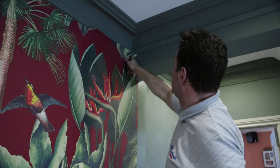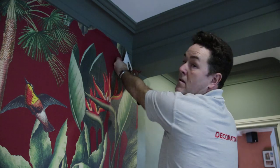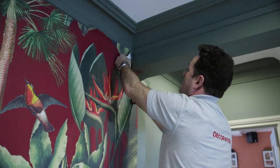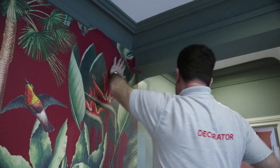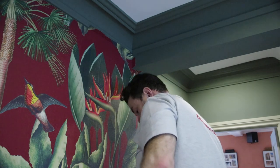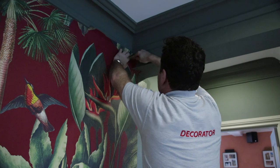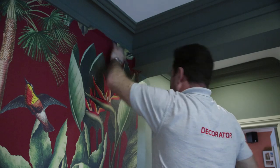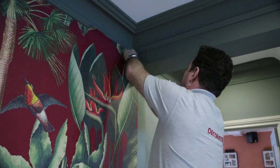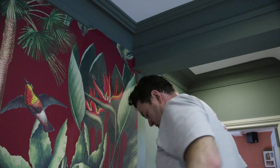What about that corner up there? Feel it with your finger, push it in. I know where it is — I'll pull it back. I can see with the way it's creased on the corner. I'm just going to cut into it — not all the way. Then I'm going to cut straight across that angle. It doesn't have to go straight up to that corner. I've got it all in. Let's not forget where that screw raw plug is — poke it through with the screwdriver. Let's get these down, put them really neatly in. Let the paste up — there might not be enough paste there, move it all the way up. I've got a smaller straight edge, I'm going to use that — get it against the corner.